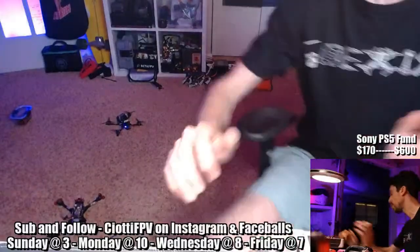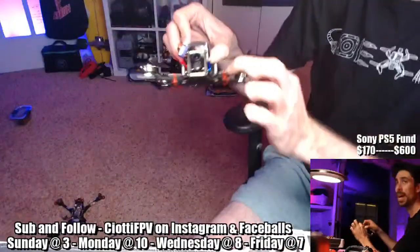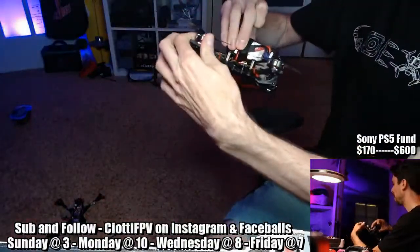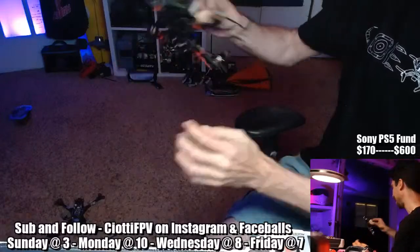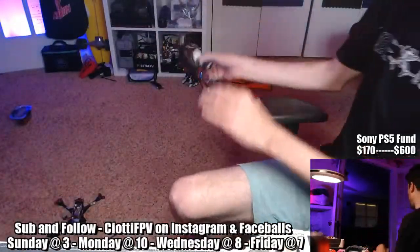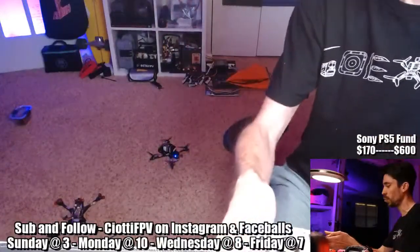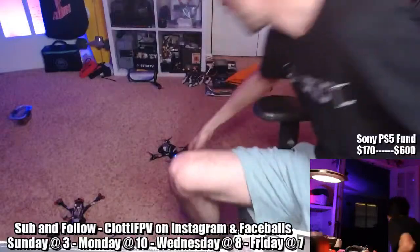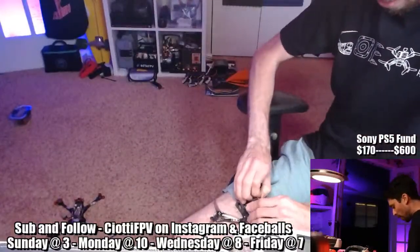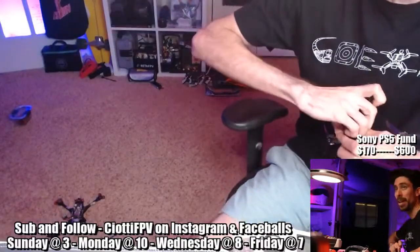So by moving the throttle around like that, what I'm doing is I'm putting it into different RPMs. You want to check your motor heat as quick as you can. I'm putting it into different RPMs and just listening for any weirdness at different RPM values. But in this case, we seem to be fine. It sounds really, really smooth, and everything is reacting the way that it should be, and there's no weird grindiness or grumbliness or anything really.